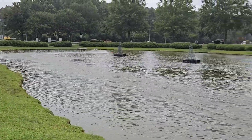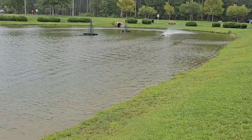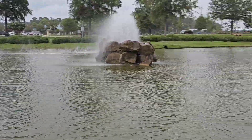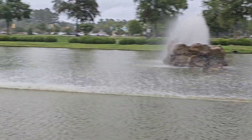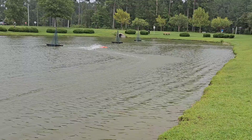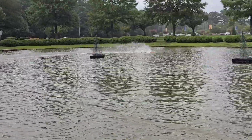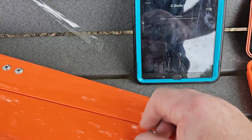That looks good. I'm actually kind of glad I got my CG a little farther forward. Plenty of water cooling coming out. She looks like she's lifting a little bit, so I need to get this strut dead nuts flat when I run this prop — I've got a little up on it right now. That is pretty. I want to hit it again but let's check the temps real quick. That's a lot of cooling coming out, both holes. 68 — that's my PB with this boat!